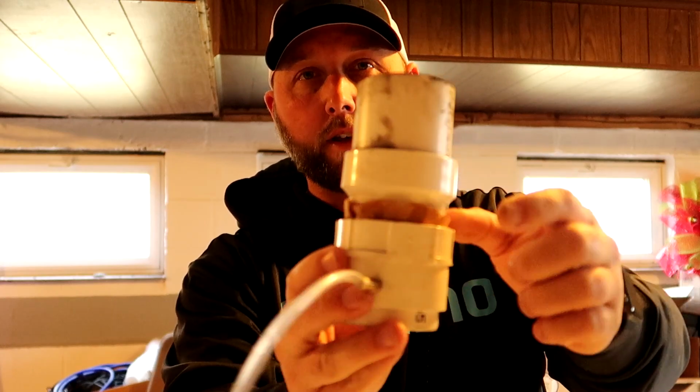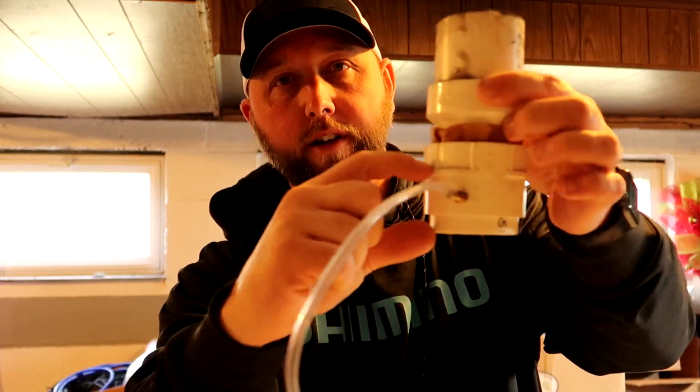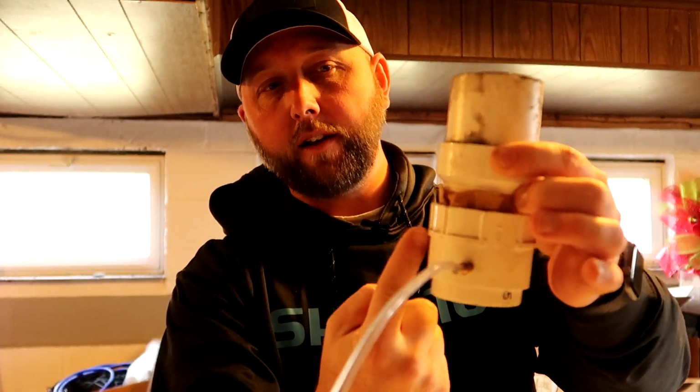So what I do is I take the lid off of this stuff. I have built a fluid bed here, nothing more than a few pieces of PVC that's hollow, obviously, on the inside. And at the bottom of this, there is one single piece of brown paper bag that you can get pretty much at any grocery store. That's screwed in there, and so there's an air chamber down here that fills up with air, and then it actually forces air through that brown paper bag and creates air that flows through this very, very evenly.